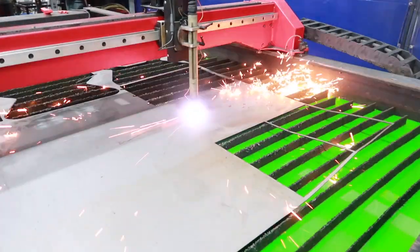So the first thing I'm gonna do is get a drawing made up in CAD. And once I'm happy with that, I'm gonna send it over to the CNC plasma, get that cut out, and then we're gonna bend up this vise. Here's just a quick project. Probably not going to fully weld this. I'm just gonna make it so that it bends up and has some tabs on it. It doesn't have to be crazy strong. I'm gonna make it out of 1/8 inch plate.